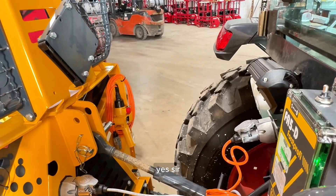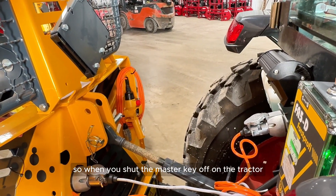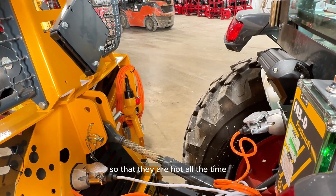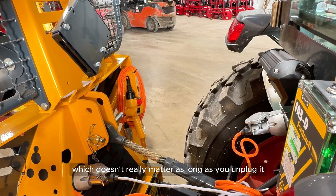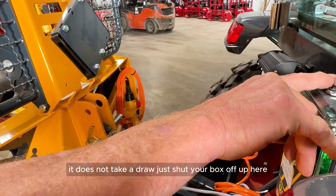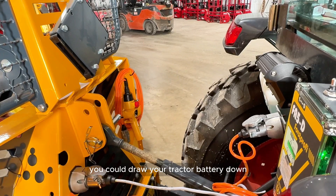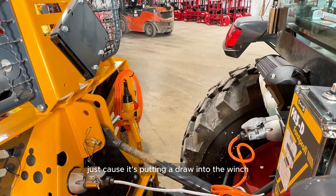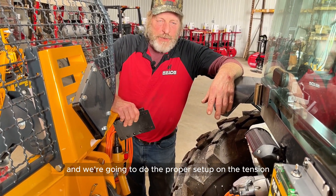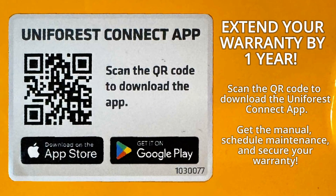We've got light now — you've got to turn the tractor on and make sure your tractor power is on. We've got this wired in so when you shut the master key off on the tractor, it shuts off all the power. A lot of guys wire them so they are hot all the time, which doesn't really matter as long as you unplug it. If you want to leave it plugged in overnight, it does not take a draw — just shut your box off and that shuts off all your power. If you leave that on overnight, you could draw your tractor battery down just because it's putting a draw into the winch. Now that we've got everything hooked up and wired properly, we're going to take the winch outside and do the proper setup on the tension for the cable and exercise the remote controls. We'll see you next time.